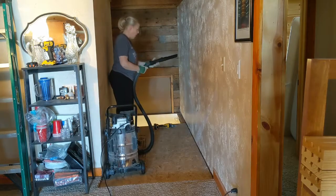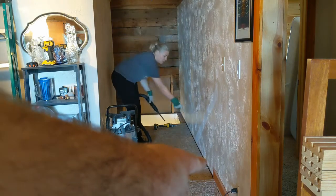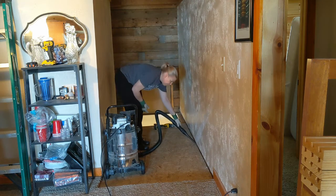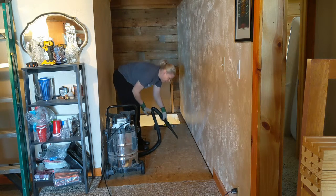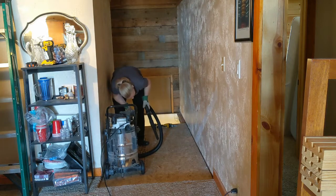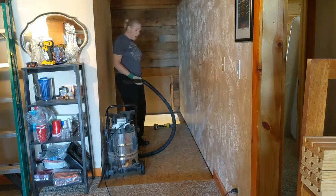Okay. What we're going to do here is cut away some of the drywall on the right-hand side over there. Yes, where my lovely assistant is pointing. That way the board, which is a little bit too wide, will clear and we can lift it up. So this is going to be like half an inch. Yeah, not very much. And I'm not even thinking of cutting it flat, but maybe just angling it. And then we can cut it off later, because we're going to have to cut it off or put trim baseboard up around the edge anyway. Okay. So we'll see. Let's do it.